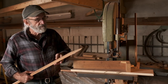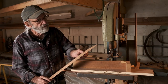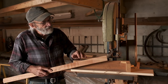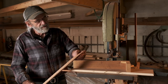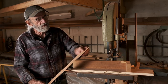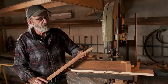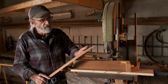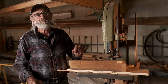And there you have it — a very nice scarf. Very smooth, nice and square across, completely done. We had that little adjustment available but I didn't have to play with it. It really does a nice job — perfectly smooth for gluing right there. We don't mind if it's got a little bit of a saw texture in it because it just makes the glue hold that much better. That's the way we do it, and like I said, we've done so many of them already with this same jig. It works absolutely perfectly.